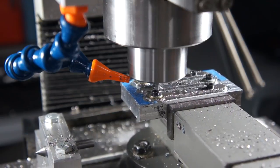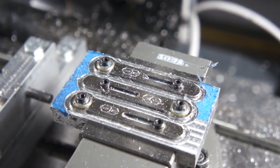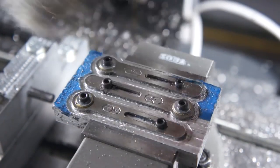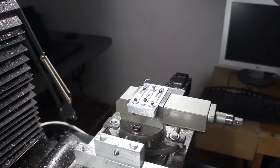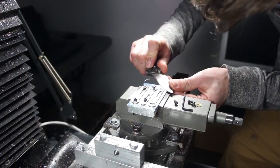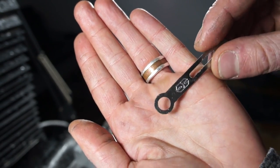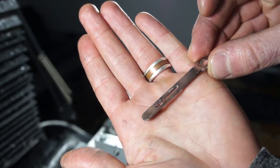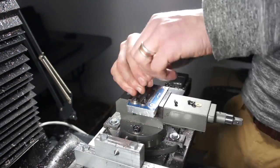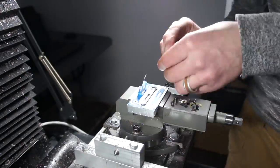For stock ball screws I'm incredibly impressed with the edge finish coming out of these parts — it's quite nice. Here's the part fresh after milling. I didn't capture the engraving operation on camera but it's the same method — the mill comes down and makes the engraving. I had zero issues besides the slow feed rate and the parts came out almost perfect. The tape and superglue held just fine even under all that oil. There was a slight burr, likely due to feed rate, but just wiping across some paper on a granite block was enough to knock it off. And that was the part ready for bending.